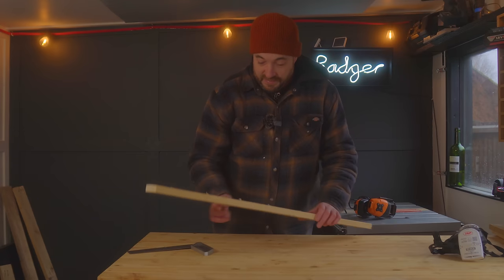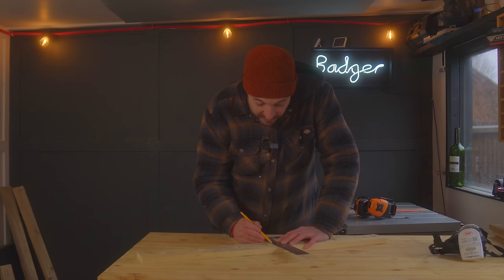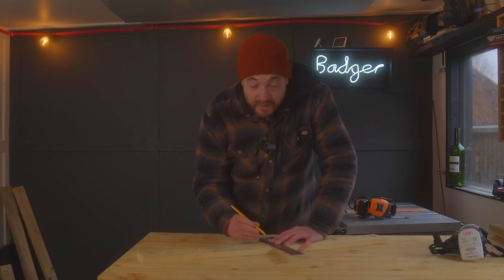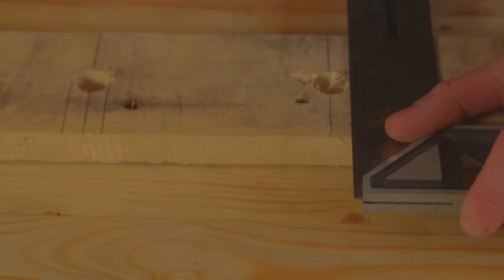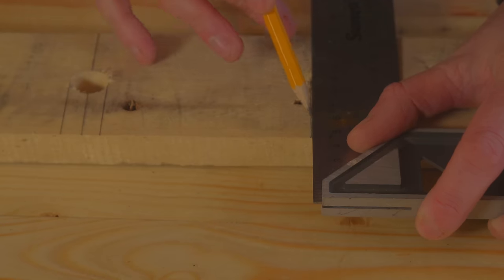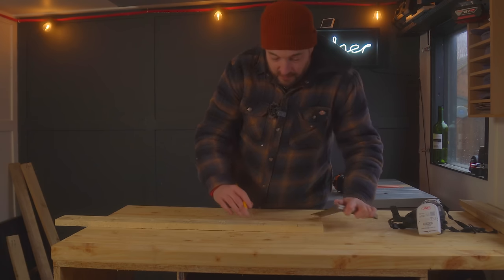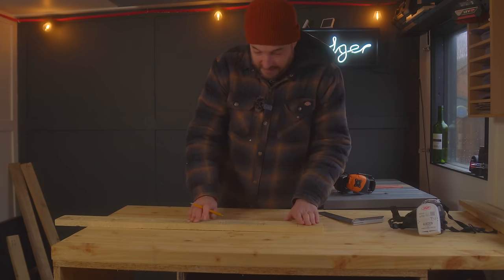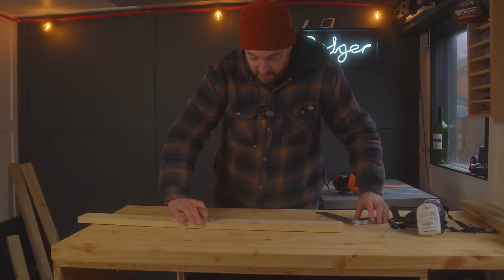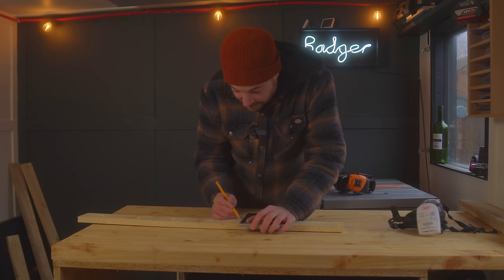I've got all the holes in this now, so I'm going to get a square and line them up with the edge of the holes and draw a line joining up the side of the hole to the edge of the board, because we need to cut this open so we can actually get a wine glass in and out. I've made this mistake before because of the throat capacity on a bandsaw — from the centre to this side I've got this, and then I'm going to flip it over and draw the other ones on the underside, because I'm going to need to do this from both sides when I get to the bandsaw.